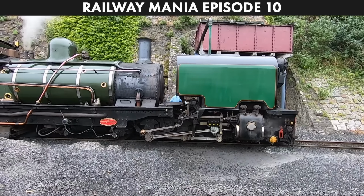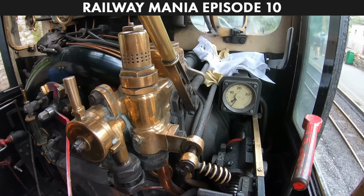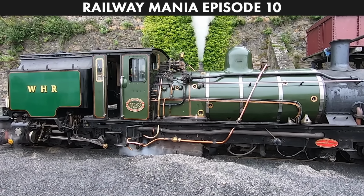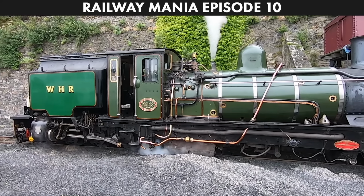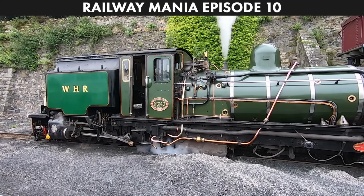Yeah. There you go. One more thing I want to talk about was the braking systems that are incorporated on the locos that you operate. Are there separate train and loco brakes on each one? Yes. They originally had steam brakes. They had a relatively small steam cylinder in each rear corner of each power bogie. That was the first incarnation of the Garratts. The NG 13s also had that, the type before this.